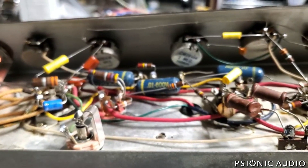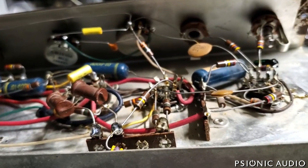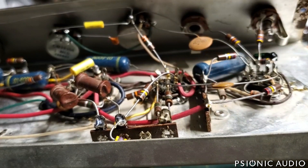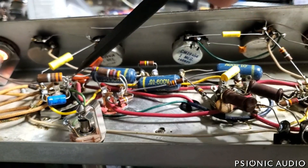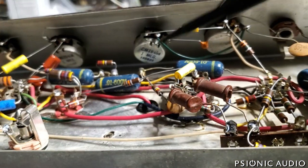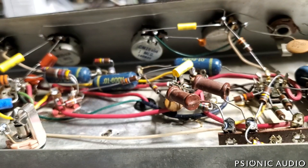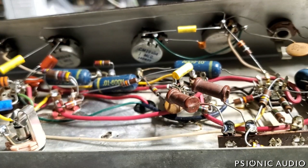There's the added Switchcraft jack for the speaker. A couple of changed components there, which made the tremolo have a little more depth. And crucially, right here — this cap had to be changed out, and this cap, and this cap, and this cap down here were changed out. I've verified that these three caps in the LFO circuit were good and not leaking. Overall, I'm very pleased with how this came out. Stay tuned for the actual playing video.